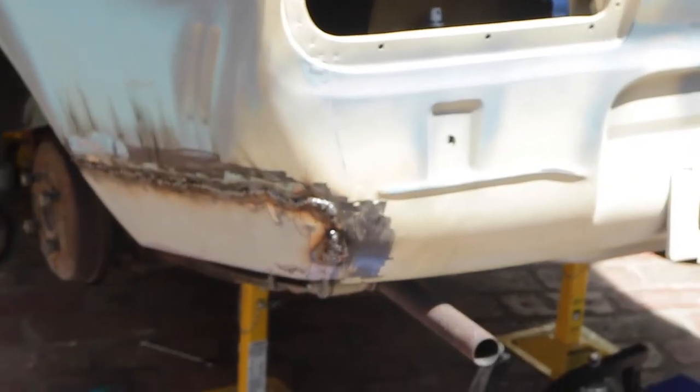All right so it's all welded in. There were a lot of pinholes in between certain welds which I'm trying to fill and grind back now. Some of those areas are so built up because that's where I was having blow-throughs and I had to fill it up - the more I was welding the more it was just blowing through. The Instagram for the YouTube is running now - bio is down below. Any comment or subscribe really helps. That's it for this episode of Project Y, I'll see you on the next one.